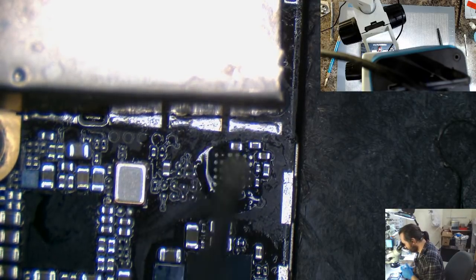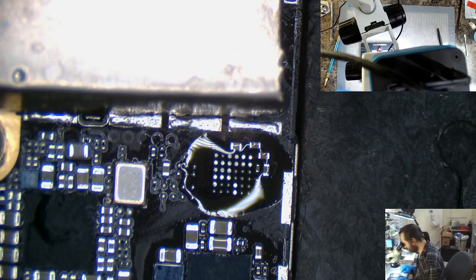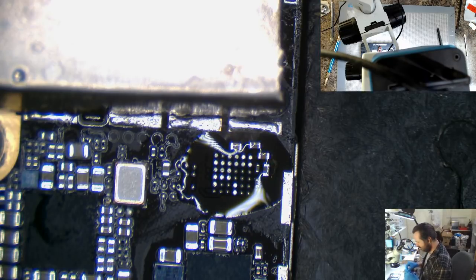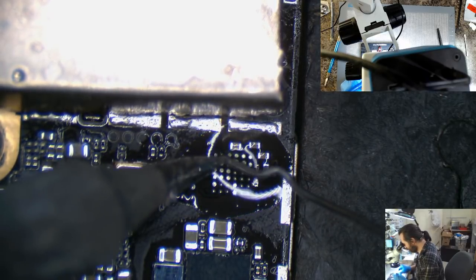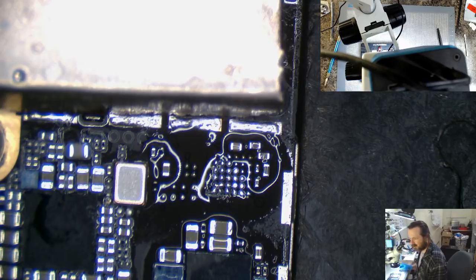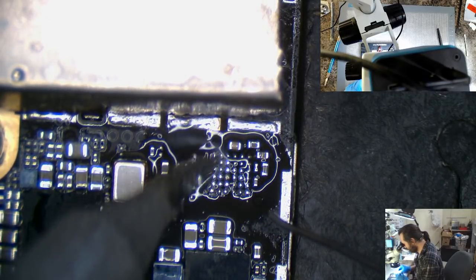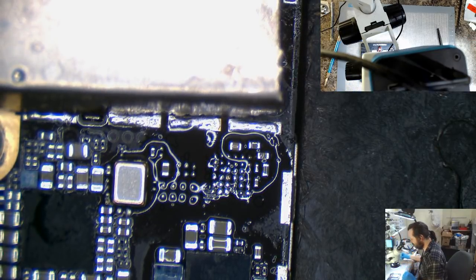Alright, since my tri-star for this is going to be a lead-free ball tri-star, because it's supposedly fresh and new from the shop, I will be putting down some leaded solder here so as to appropriately salt the lead-free ball alloys into flowing. Otherwise what happens is it just takes too long for the BGA to suitably reflow, and when it does start flowing it just feels all yuck. Except I'm doing a dreadful job here. Oh well, I might have to hot wick this.